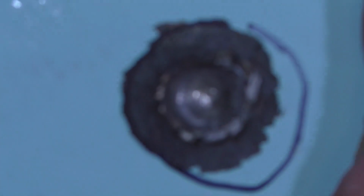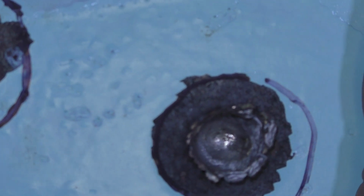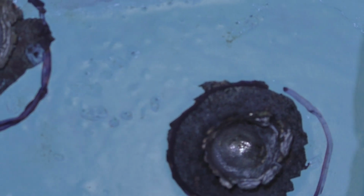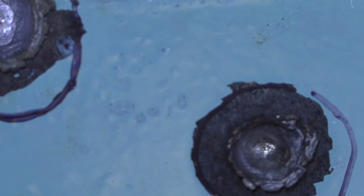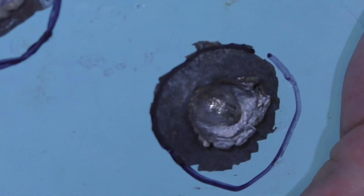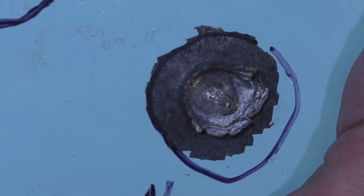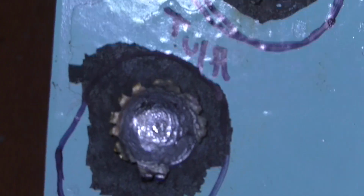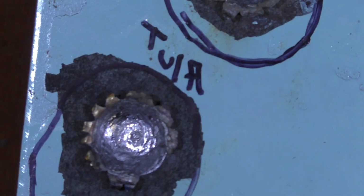maybe bring that up or leave it there. There we go. You can actually see it seems to have an inner area where it goes down in more deeply than the Tula did, and it doesn't splash out at the bottom like that. It really pretty much drives a much straighter hole down in. And maybe it doesn't come out on video quite as well, but you can kind of see where you can tell where the steel core impacted the plate. And with this, it looks like the lead just hit it and flowed out. But that is on mild steel